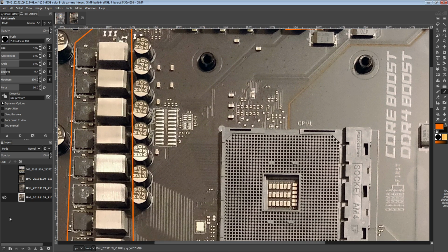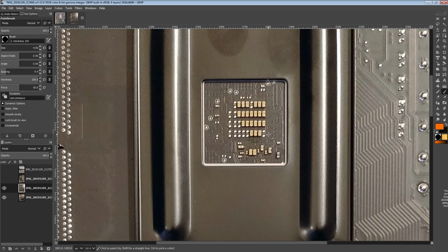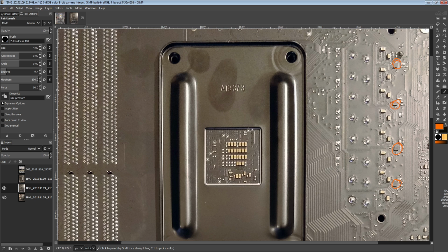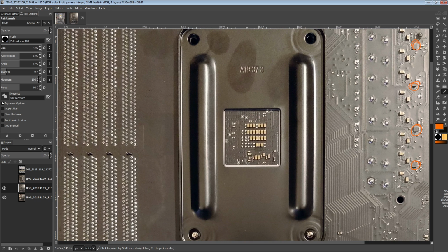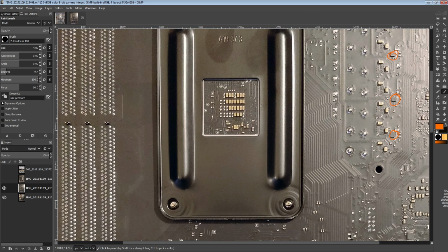I guess those were just deemed unnecessary. It is very possible that they went and tested the VRM and were like, well, if we remove all of these, the transient response gets worse by 5 millivolts. Who cares? Or maybe our transient response under worst case scenario, so like 0 milliohms load line, gets worse by 20 millivolts, and it's just like, well, you shouldn't be using that much LLC anyway, so who cares, right? And in the LLC ranges where the motherboard is actually intended to run, this doesn't make a practical difference to the performance.